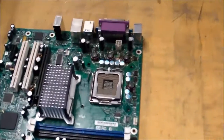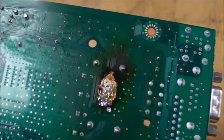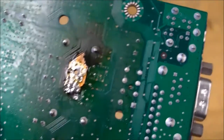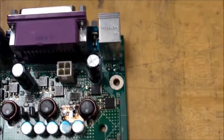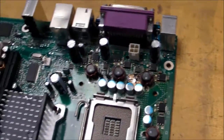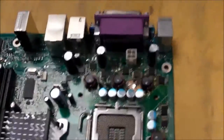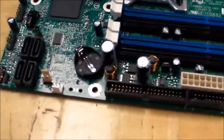I got a lot of helpful comments. One person commented that I should drill out the via that the bad MOSFET was in, because I was measuring on the circuit board a resistance between gate and drain — the gate and drain traces on the circuit board — and that's not good. So I drilled out the via to remove any potential solder bridges. The resistance was still there, so this motherboard really is screwed. I won't be able to use it anymore.